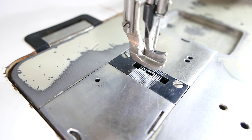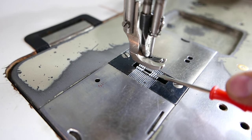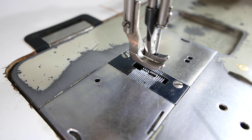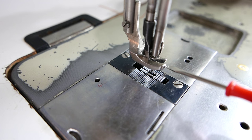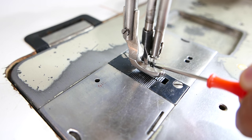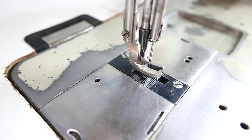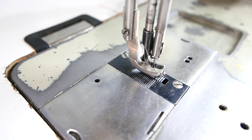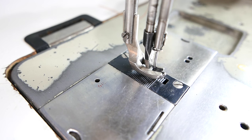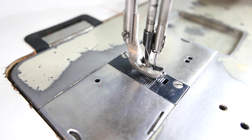The drop feed is typical to most sewing machines — you have the feed dogs, which rise up and push the material back, or forward in reverse. But a triple feed also has a foot which meets the drop feed. As you can see, the needle is now down, and as I advance the machine, the needle moves back with the foot and the drop feed. So now we've grabbed the fabric with the needle and moved it to the back — that's unison feed.